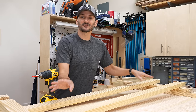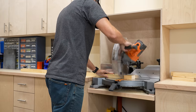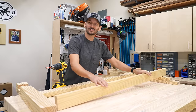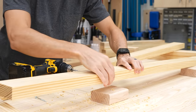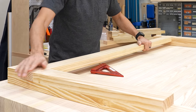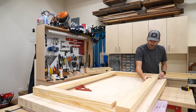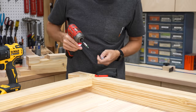I've got everything now for the side assembly. I went ahead and cut the stretchers to length for the top and the bottom — these will get attached into the joinery we made a little bit earlier. Before I do that, I want to drill some holes in the underside of the top stretcher for attaching the base to the top. I'm going to preassemble this and drill some pilot holes, because once you get glue in there it's like wrestling a greased pig. So I'll pre-drill in the dry fit, and then when I put the screws in it'll just go right back into place.